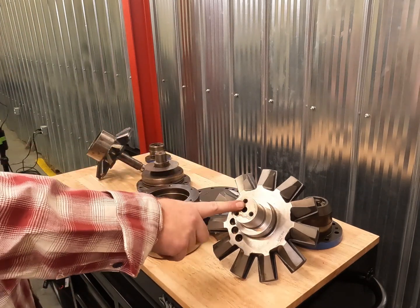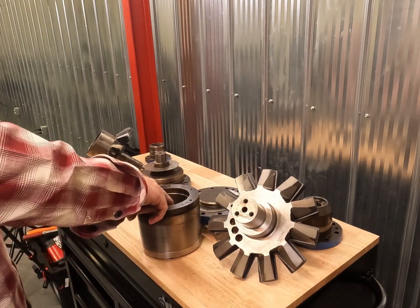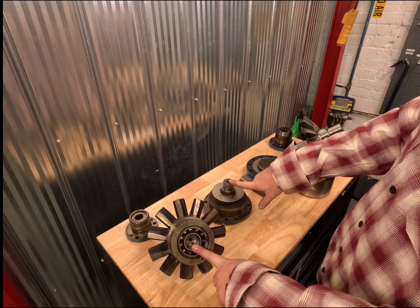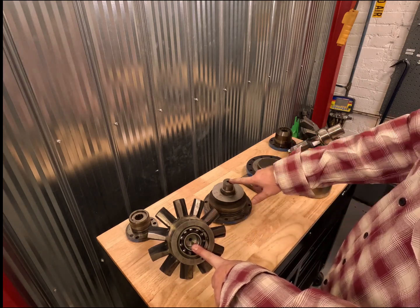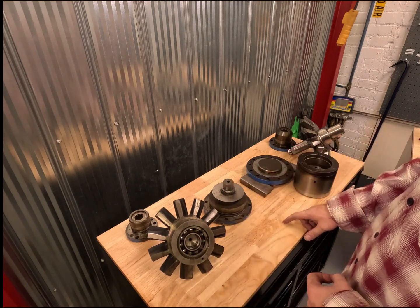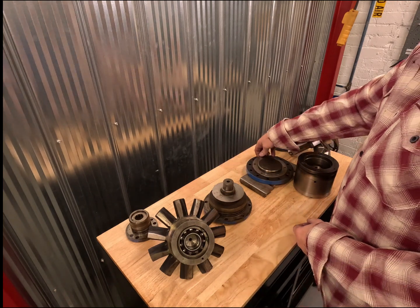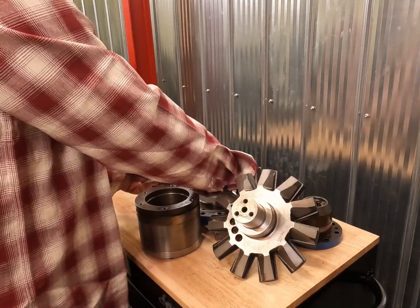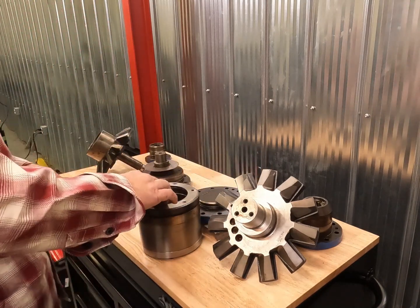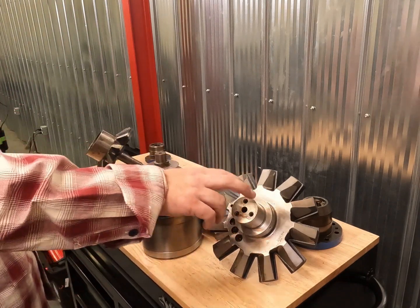This holds the inner races in place. For the VSM, it's held through a bolt through the cover that locks us into position. For the VSS, to set shelf clearance, we use a series of shims between the bearing housing and the cover to lift and locate the support.